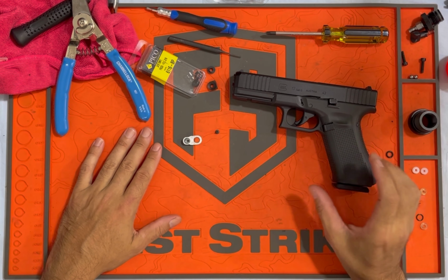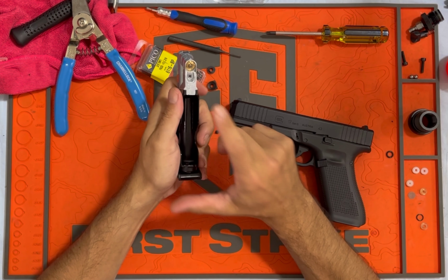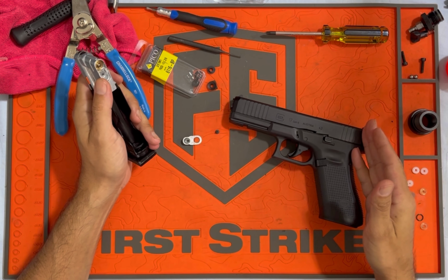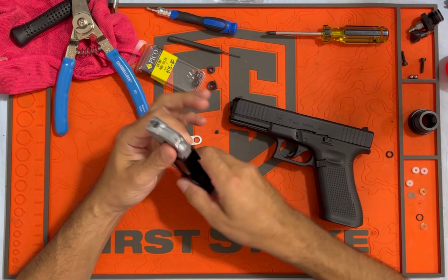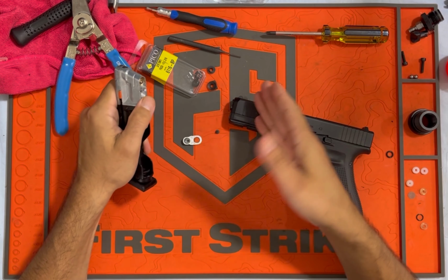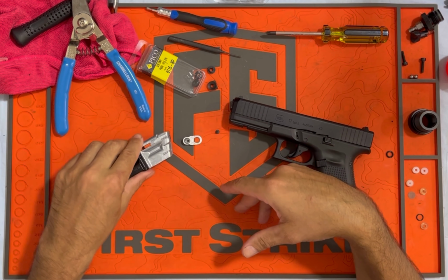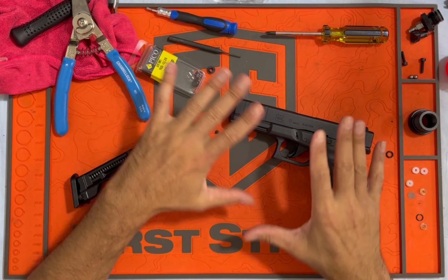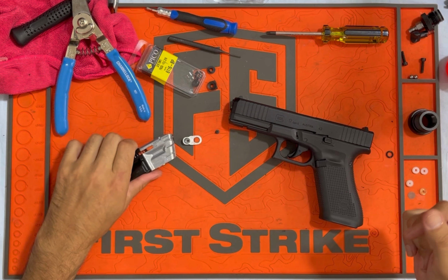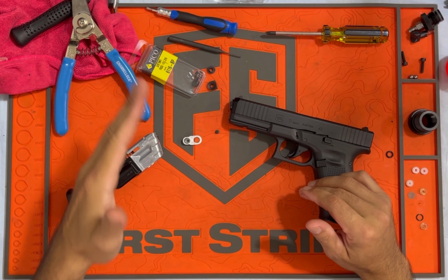Let's see if drilling that puncture pin did anything. And oh yeah, along with the hammer springs I ordered some 11mm glass balls. I'm very curious as to how those will do and their exact weight. As you know, I've been shooting steel ball bearings. They're 5.4 grams. I've had my best results on them. But I think they might be a little bit heavy for this. Now, that remains to be seen. So let's air this guy up, see if it did anything. Can I top my 210 feet per second number?